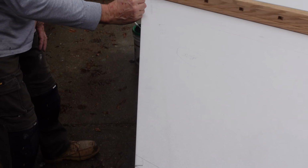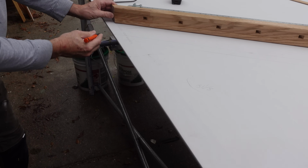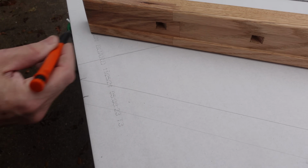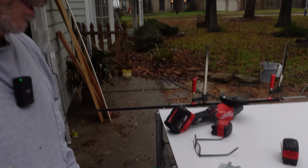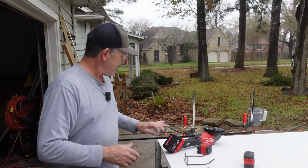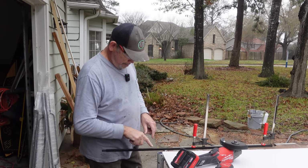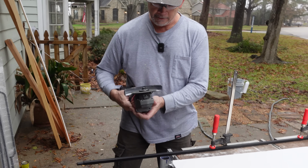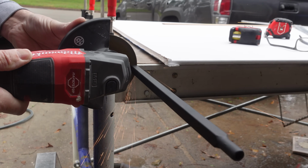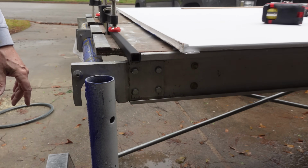And then for the top, measure to the bottom of the handrail, I added 1/2 inch just to get us inside our little mortise we made. How many times am I going to say mortise? So our final length is 31 1/8. I've got a baluster already marked right here. Let's cut it off. Nothing to it.